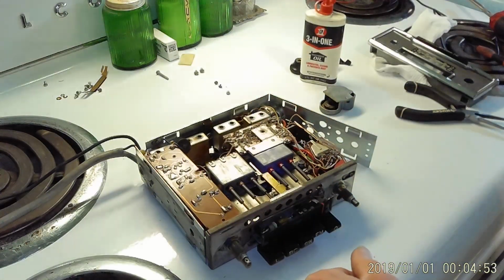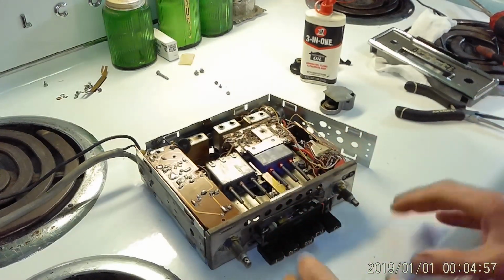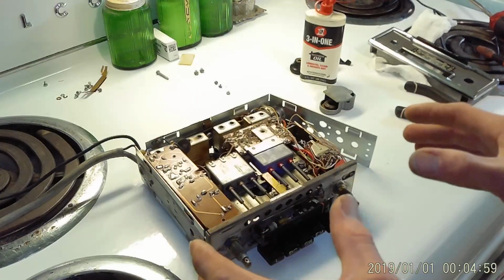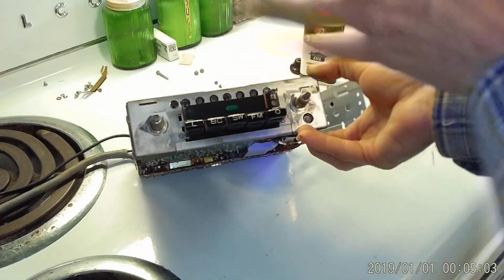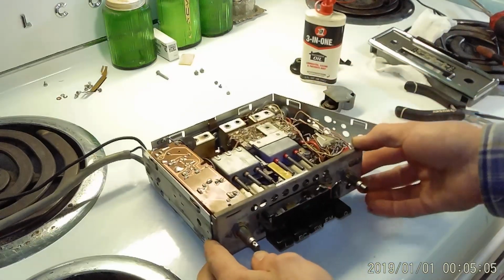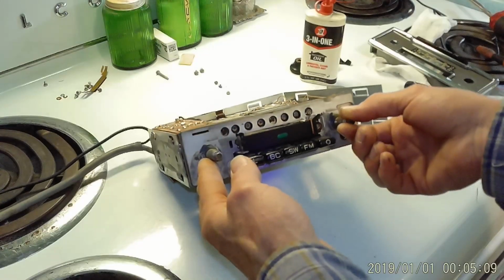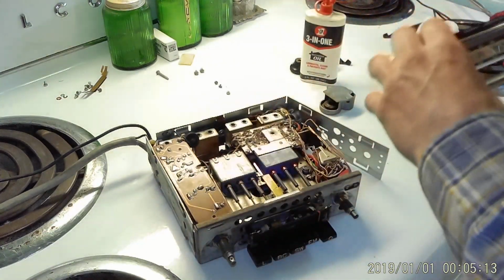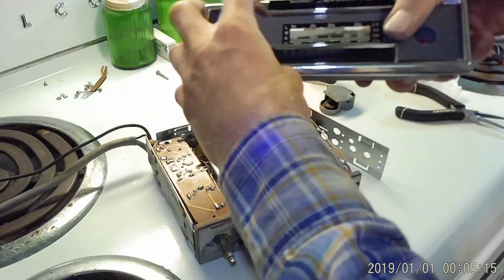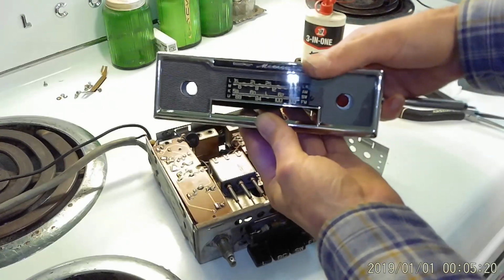And it allows the light bulb to light up enough at night to where you can see the dial scale, and even the little green pilot light lights up a little better. And it won't light up so much that it's distracting while you drive at night, but it lights up just enough to where you can eventually see the number scale on the numbers on the dial scale.